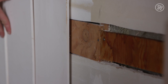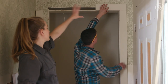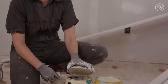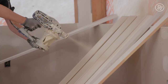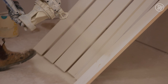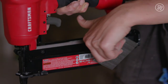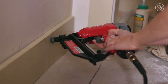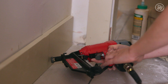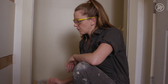Talk to me about doors, door framing. It looks good — I like the way it looks. So you have to trim out this door, this opening. Because I'm painting all these trim pieces, I'm going to use the subtle semi-gloss. Usually walls are some sort of matte finish like an eggshell, and trim is more of a glossy finish, just because they're easier to wipe down. So this takes about two hours for that first coat to dry, so I'm going to let that go and then come back and do a second coat. So this is a 16-gauge nail gun, and it uses air compression to shoot these finishing nails in. When you're using them on finishes, it's just a little pinhole — you can wood putty it, and then paint over it, and you won't even see it. We've got a seam and it looks a little rough right now, but that's what the finishing touches are for — you sand that out, add some wood putty to these nail holes, and it's good to go.